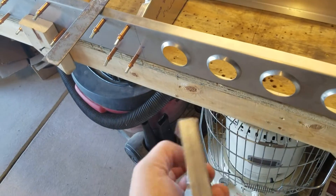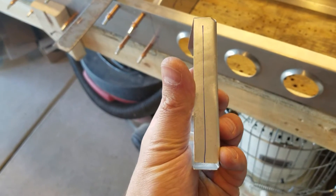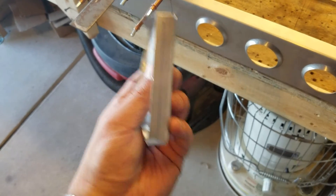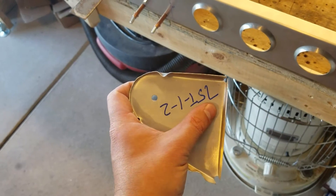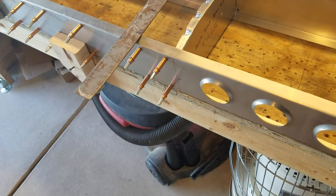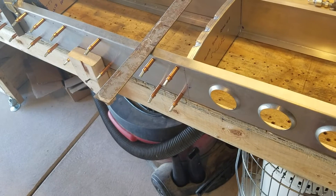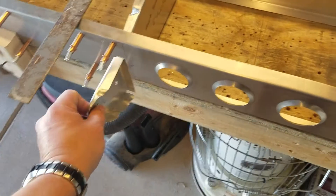The reason you don't want to do that is because if something moves slightly or the drill chews an irregular hole, with the pilot hole you can correct that with the final match drilling. But if the first hole you drill in this piece of material is the final size hole, you can't correct anything unless you drill an oversized hole. In that case, you can drill it again with an A5 rivet and set an A5 rivet in there to compensate. However, if your final hole size is supposed to be an A5, you can't step up to a larger pop rivet. With the materials we're building this plane from - primarily A4 and A5 rivets - you don't want to step up to a larger rivet yet to compensate, because doing that too many times adds quite a bit of weight.